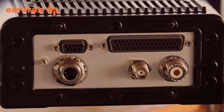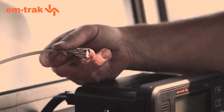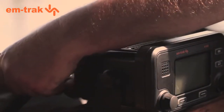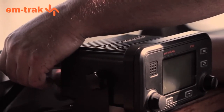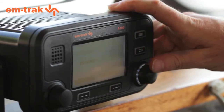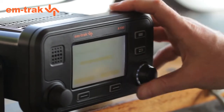Our Class A is very sophisticated and can be connected to many bridge systems. Before powering the unit up, firstly connect the VHF antenna, followed by the GPS antenna, and in this case, because we want to see AIS targets on the plotter, connect the plotter. That's it. Now connect the power. The unit will now power up, and the GPS will start looking to lock on to satellites.